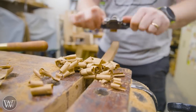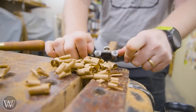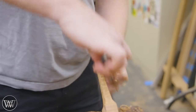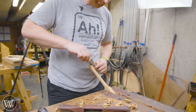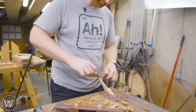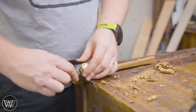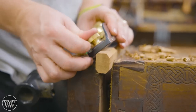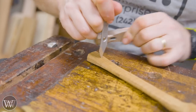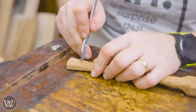I started by cutting in with a rasp to get it close to the thickness I want for the main shaft. From that rasp mark, I pull it back and trim down the handle. I'm going to round over and make the handle smooth, except for the bulb. We're just going to take this down to a shape that is relatively pleasing. For the bulb at the end, I want to make this octagonal — I love the feel of an octagonal surface, and the more I do it, the more I love it.